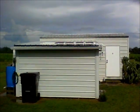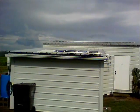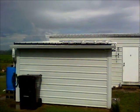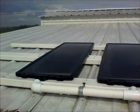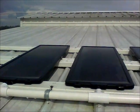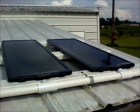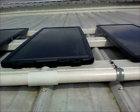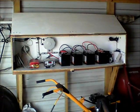I mounted the panels out here on top of my shed, and I've got my whole system out here, but I run the power to my house. Here are the panels mounted to the top of my side shed. I just used three pressure treated 2x4s, painted them white, screwed them down, and mounted the panels to them. After that, I run it through PVC pipe to protect the wires from storms, weather, sun, and aging from the elements.